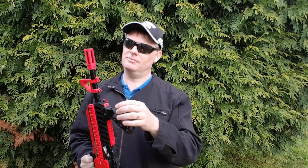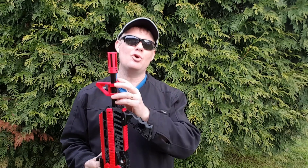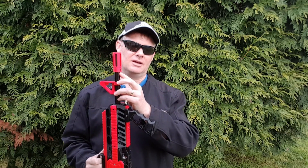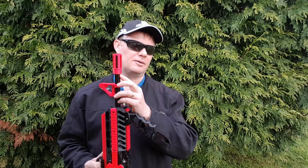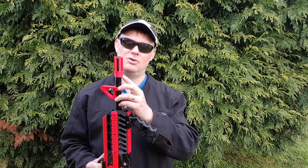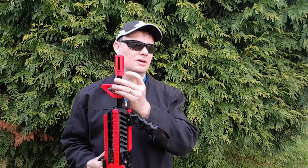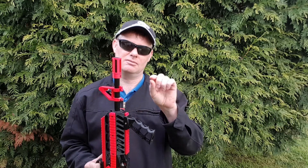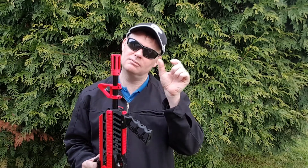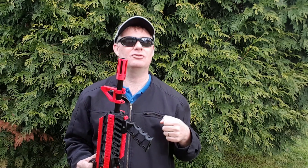It fits an M3 screw in the bottom - you can tap that. When it comes to tapping through PLA, you have to go really slowly. M3 tap, metric. You need to lubricate the tap all the time - I just used WD-40, but you probably should use something better. You can do it by hand; the slower the better. As soon as it gets too hot, you're melting the PLA and you end up pulling out a pile of rubbish, and the hole ends up being the size of the tap. Every time you do half a tap in, you need to re-oil the tap, effectively cooling it. Take a knife and run it down the tap to pull out all the rubbish plastic. I actually do it with a drill, but it's really too fast - hand tap would be better.